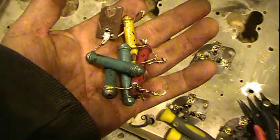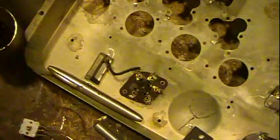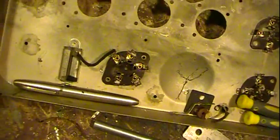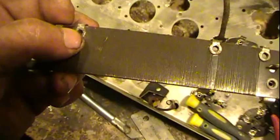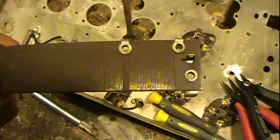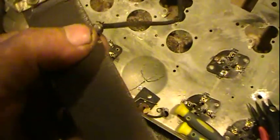The preliminary test: all these resistors are well within spec. There's only one that is just a tad bit high, but it's still within 20% tolerance. There is a power resistor — it's a divider — that dissipates about one watt. It was the only one giving me a little trouble, and that's only because they crimped these rivets down to make contact with the wire, and those were loose and needed to be tightened up. Right now I've got it measuring what it's supposed to, after basically taking vice grips and gently clamping them down.